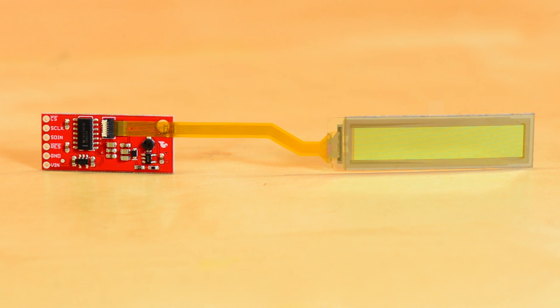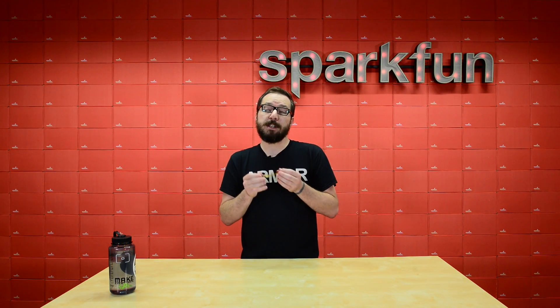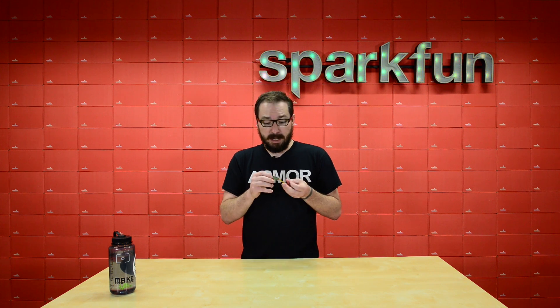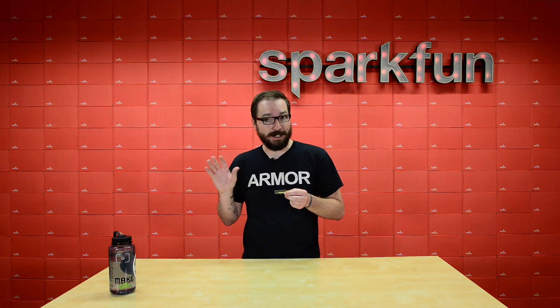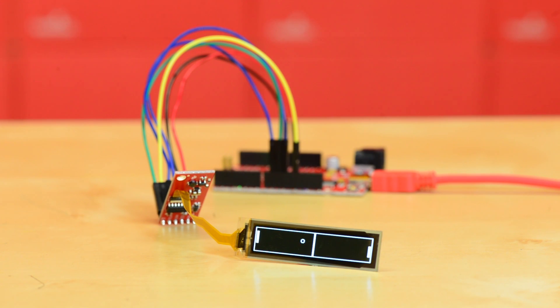It's connected to a controller board that operates off of a three-wire SPI interface that allows you to connect up to the display and load in bitmap images, text files, or even a game of Pong, which we'll show you here in just a second with ease and great clarity. To showcase what the OLED breakout actually looks like while it's on and operating, we've written this example code of an infinite Pong game that neither side has any chance of ever winning, to kind of just show you what it looks like with moving objects rather than just static images or text.